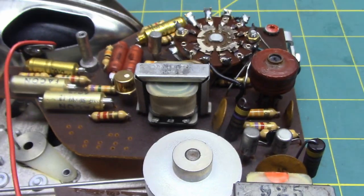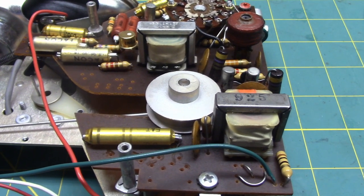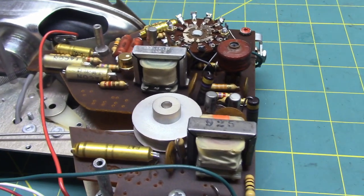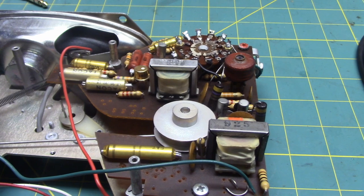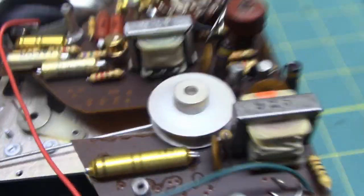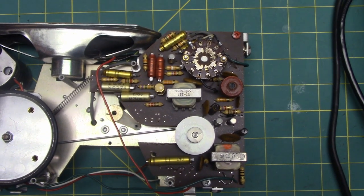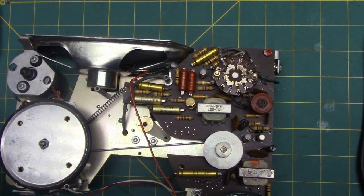It's very interesting to see West German electrolytic capacitors in this American recorder, especially considering the other parts are American — those transformers are screaming USA. The transistors are old RCA Germanium 2N408s on the output, and there's also a 2N633 in a nice golden package, which I believe is also Germanium in a TO-18 package. You can also see the AC bias oscillator transformer. One amazing thing: this is only a 4-transistor recorder, and most 4-transistor recorders are DC bias, but this one is AC bias. The original belts are still good and the rubber is in surprisingly good shape.